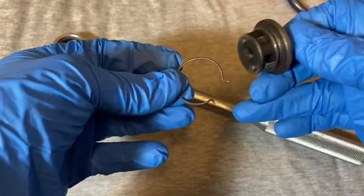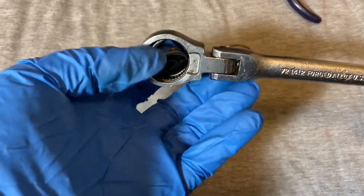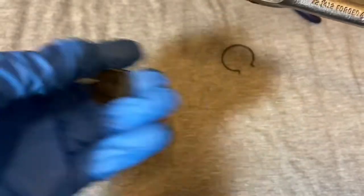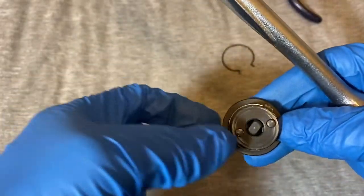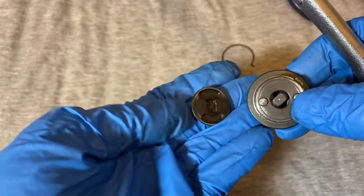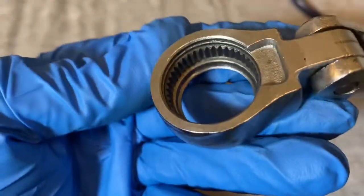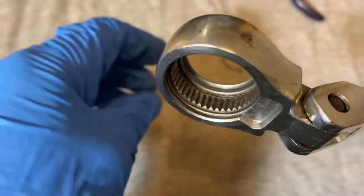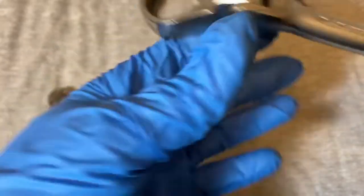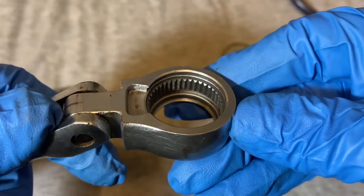Here's your ring that holds the mechanism in, and here's the switch cap — it's made of metal and has cutouts in it for the protrusions, the posts, the pins for the pawls and whatnot. Taking a look inside, this was done nicely — the broaching is overall very good.